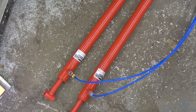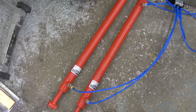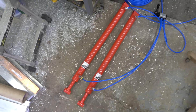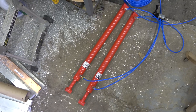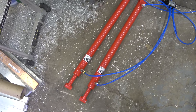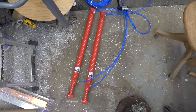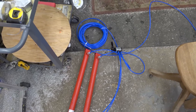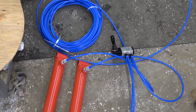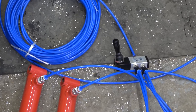Now why hydraulic cylinders and not pneumatic? Well, quite simply they didn't have anything long enough on the shelf. The cost difference isn't that much. These are far more skookum-er, but the seals are a little tighter so you get more jerkiness. To make this thing chooch, you feed pressure — it's a five-way three-position valve so the neutral is blocked off.